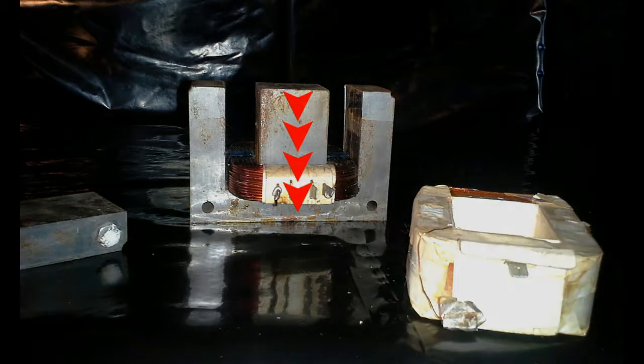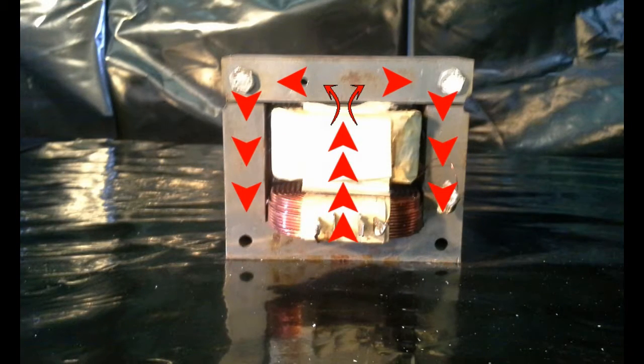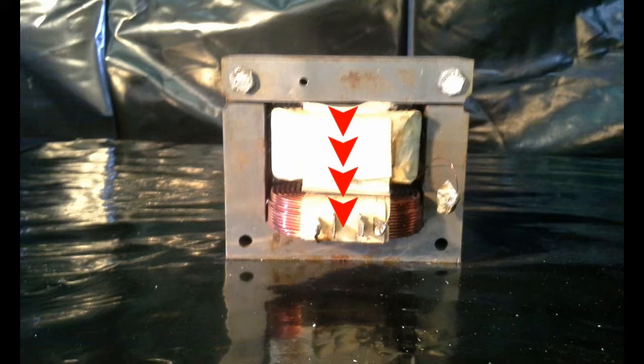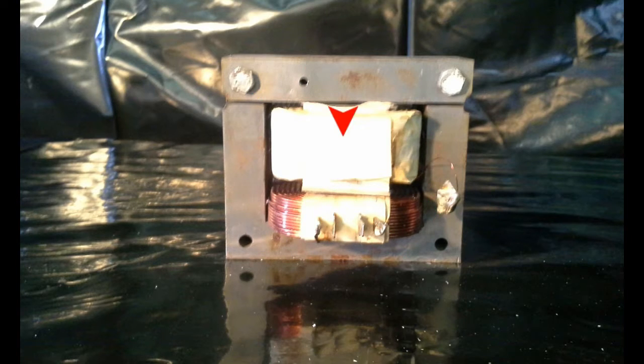off. However, when you put the cap on, it tends to make it cycle, pushes it around and back into itself. And then when it goes the other cycle, the AC current goes the other way around the transformer. So it's back and forth. Remember, both of these with the cap on or cap off, it's doing this 60 times a second, 60 cycles a second, or 60 hertz. That's the frequency of it. That's how frequently it goes back and forth. So that's what that means. But that's why when you put the cap on, you have about 4 times the power.